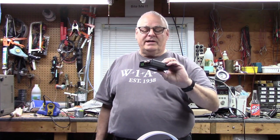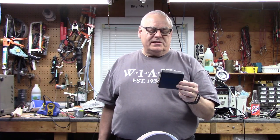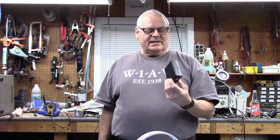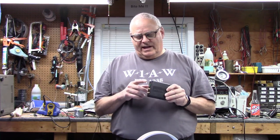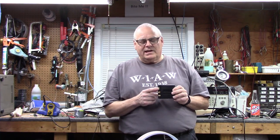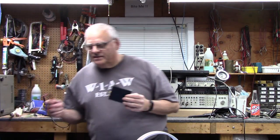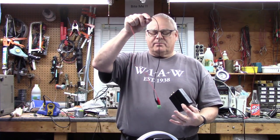So what are we going to need today? You got one of these, right — the SDR play. This is a really nice SDR receiver. This one's the RSP2. I went for the big bucks, but the cool part about this is it has a balanced input, and the nice thing about the balanced input is it's a 1k ohm input impedance.